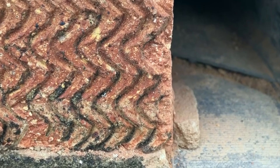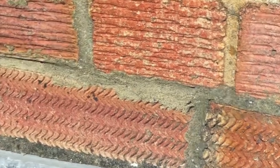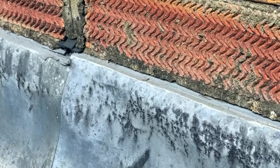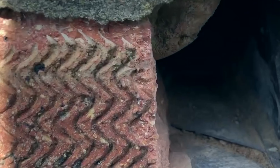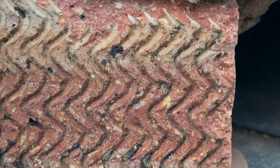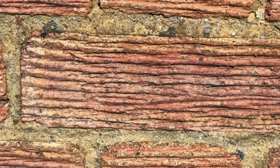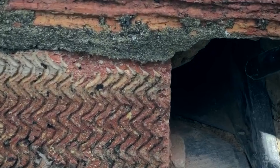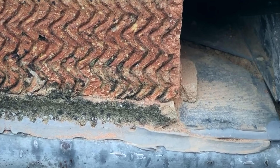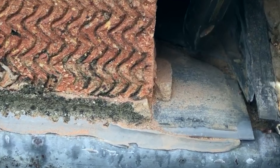This has been like this since they put the retrofit tray in. There should have been another weep vent there — we've got one that's now all jacked up. So basically any water coming down is going to have difficulty getting out. This tray is not quite turned up as far as it could be. With a hole there and some vertical cracks, water is going to come down, hit the tray, and run down into the structure.